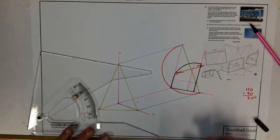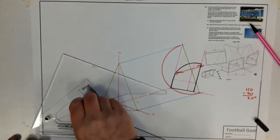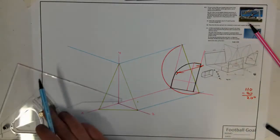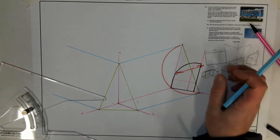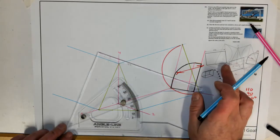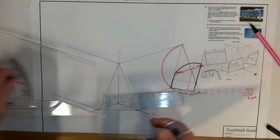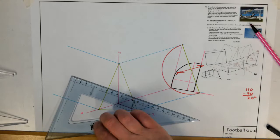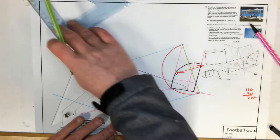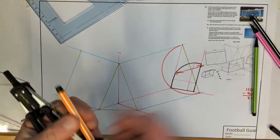Projecting the lines again — make sure when coming back to reset the adjustable to 20 degrees, as that angle was set for the Z-line. Sliding it down and confirming the angle of the Z-line is correct. Using blue lines this time, being careful not to go out too far. Estimating around 70 millimeters out — sufficient — just trying to avoid going off the page or interfering with the semicircle.